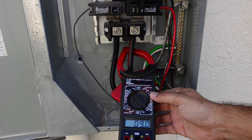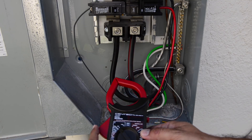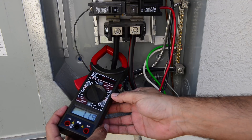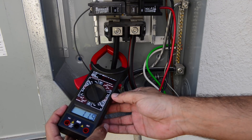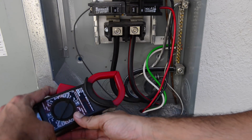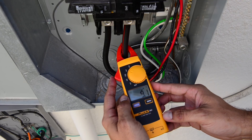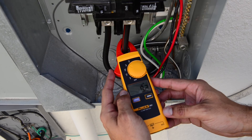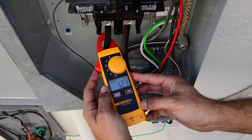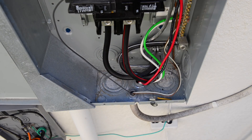First, make sure you're using the right setting for the right range. The measurement fluctuates depending on proximity to the wire — we're getting about 9.1 to 9.2 amps on one side, and about 11.9 to 12 amps on the left side. With the Fluke, set to amps for AC, we get 9.1 to 9.2 amps on the same side, and 12.3 amps on the left. I have no way to independently verify the current, but on this test they were fairly close to each other.